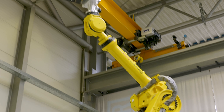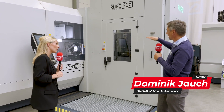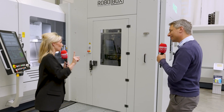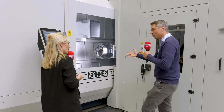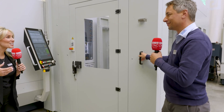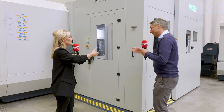Let's see the finished product. Dominic, I've never seen automation in a setup like this before. We have a big robot on top of a rack and we have four pallets inside, so we have a small footprint and you can load four pallets for a lot of material storage in the system. Why is this back? Because if you need to set up the tools and the jigs, it's very easy — you have good access to the machine. And if you need the robot, you just take the sheet metal cover and put it out, and then the robot gets access to the machine. Very easy, very light. Small footprint, but where do the components go?